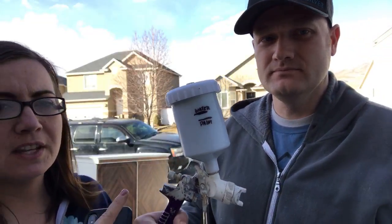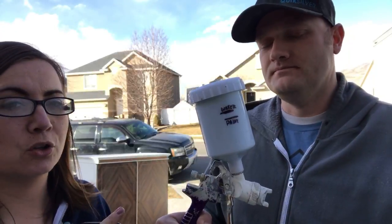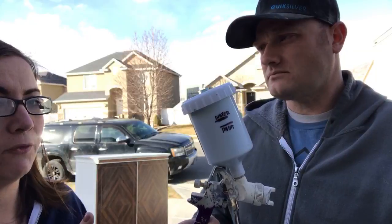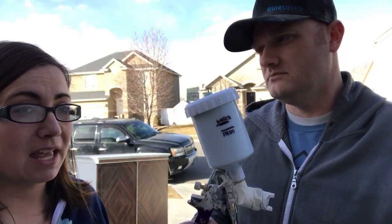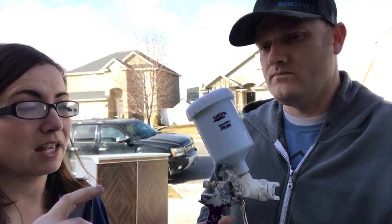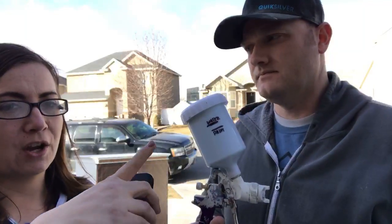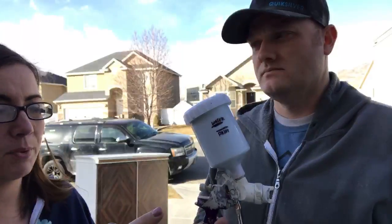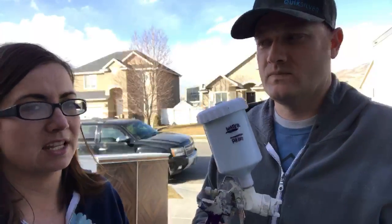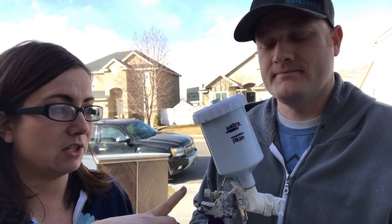To be very specific, this is just the ratio that we use for DIY paint. When you're using other paints, the ratio is going to be different. DIY is clay-based, heavily pigmented, and very thick paint. That's why we have to do 3 parts paint to 1 part water. If you're using something like Fairy Chalk Mother or another chalk paint brand, they're not as thick, so you're not going to add as much water. But this is specific to the DIY paint that we sell at jamierayvintage.com.